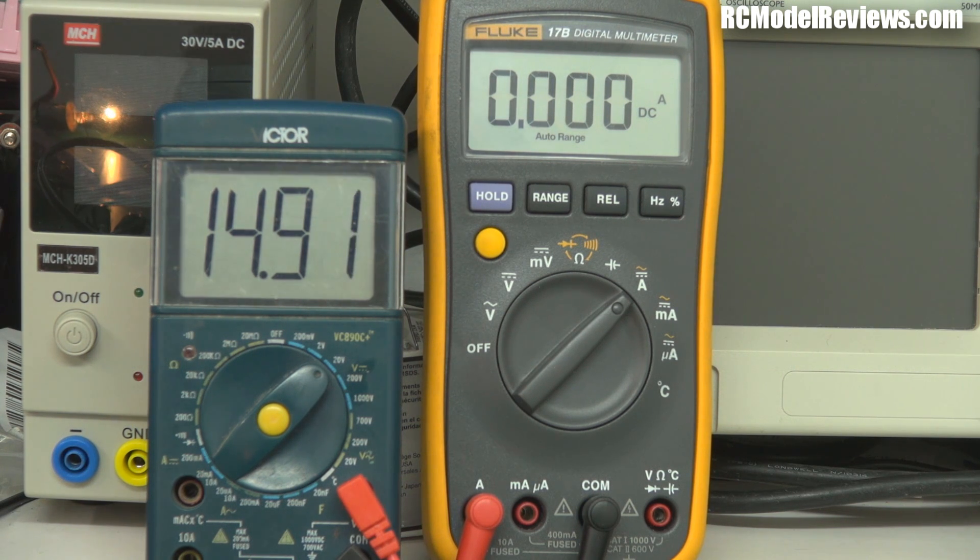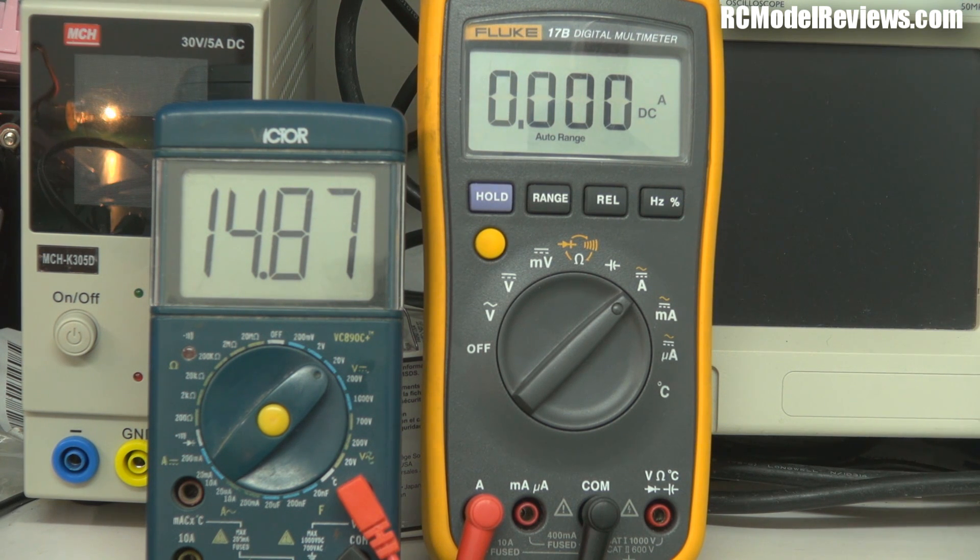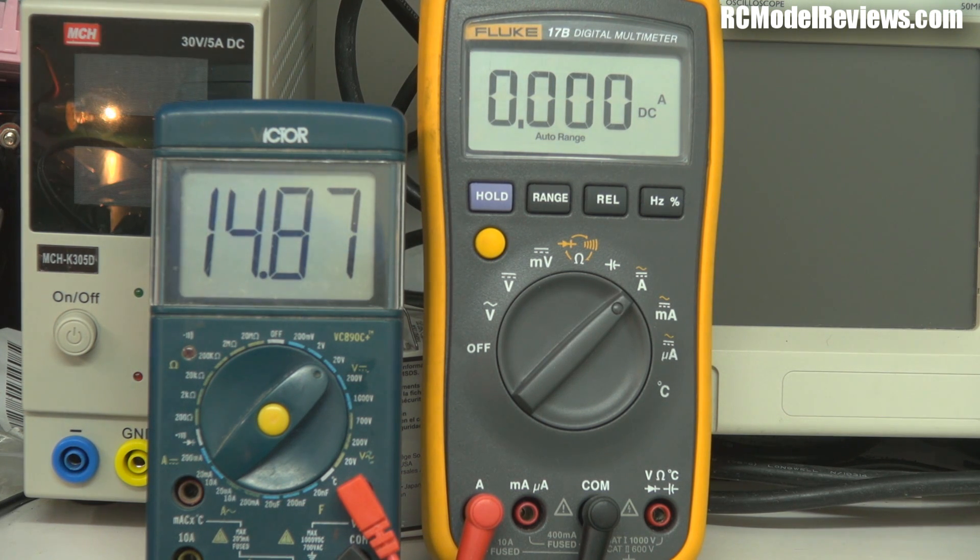Time is a factor in this calculation because the battery is discharging and voltage drops continuously. I need to quantify how much voltage drop is simply from normal discharge versus from internal resistance. Running the load for 20 seconds, the voltage drops, and when I turn it off it doesn't return to where it started - we've discharged some of the battery. From this test I can determine we're losing about 0.04 volts every 20 seconds, or 0.02 volts every 10 seconds. We need to subtract this from our total drop.